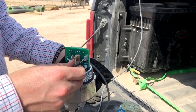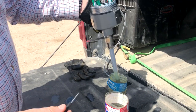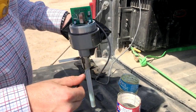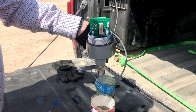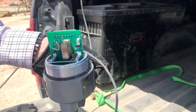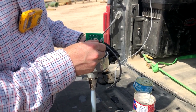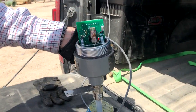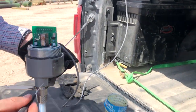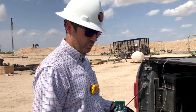Still not tripping — went a little too far, so now we're tripping in the water. We'll go a little bit more because it's not tripping quickly enough. That should be about it. You just want to make sure it's tuned to where it's not tripping in oil but it is tripping in water.